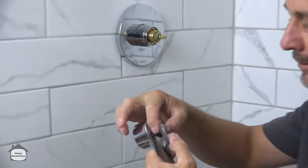Now, the last thing is to attach the hose, and we come over here. I remember when we were installing the rough in, I told you to take the drop ear and set it flush with your wood so that you can use a 1.5-inch male thread to male thread, okay? And this will work out perfect every time. Now I get to see if I was full of it. Now, again, because we're going inside a wall, I'm going to suggest we go about 7 to 10 times on here. And some of you might think that's ridiculous, but it takes 6 seconds of my day.